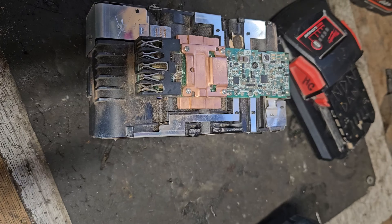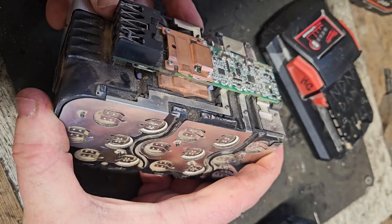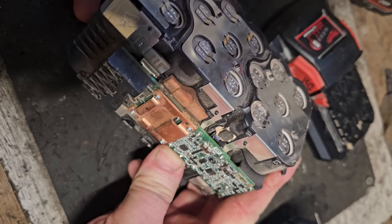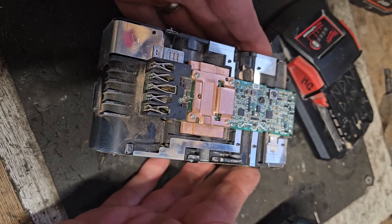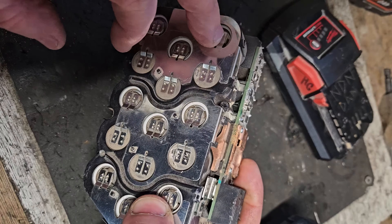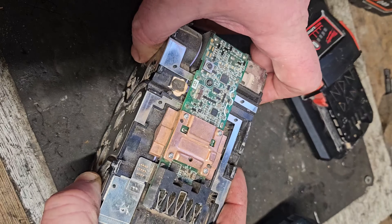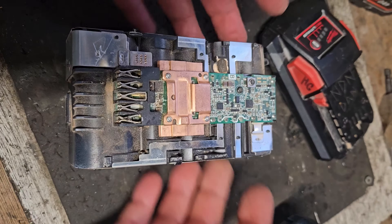That's why she's losing a few volts, and it makes a terrible difference to the performance of this battery — more than you would think. The battery is operating between just below 18 to possibly 21 volts roughly. This battery could be losing up to a volt in power. But the real issue is that the cells have to carry the load equally, and when this one goes down to 3.59 or 3.5, that's actually shutting the tool down to avoid over-discharge.